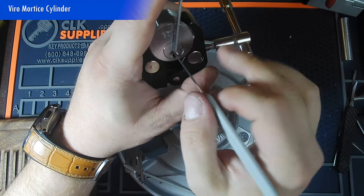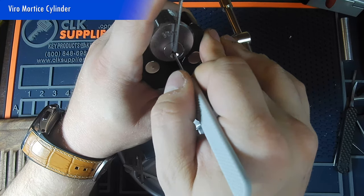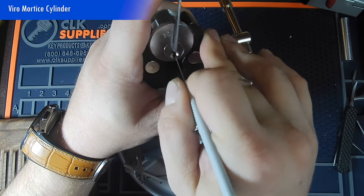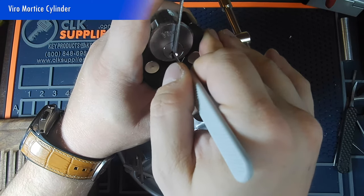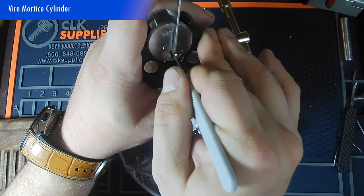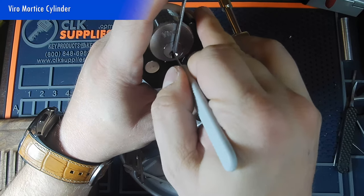It's got quite a bit of slop in it, so there's probably a security pin or two in here. I'm going to start on the first pin, medium tension. First pin is binding — click on one. Going to two — two is binding. I might have too much tension. There we go, click on two, and we just got a false set. Click on three — I haven't actually had a click on three, but it gave us some counter rotation. We got a deep click and we're back to that false set. There are definitely some spools in here.